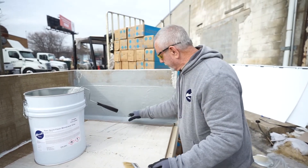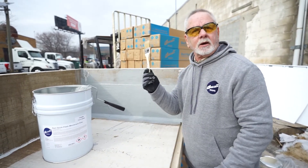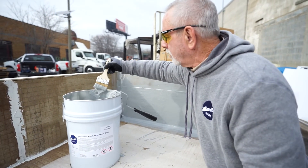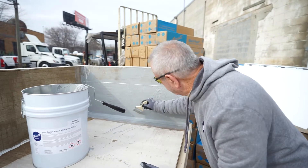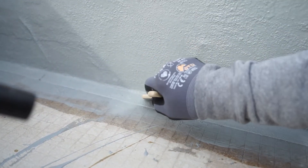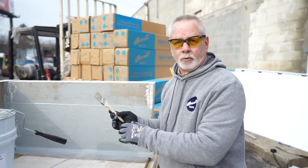Sometimes as you're using your roller, you'll get into some tight areas where you won't be able to cover the fleece. At that time, you take a brush, dip it into your resin, make sure it's coated, and then pass over the fleece — and as you can see, it's covered 100%. This is a back-pocket tool that will get into crevices and cover areas you were not able to reach with the roller.